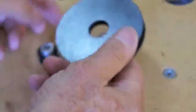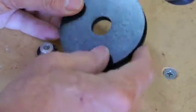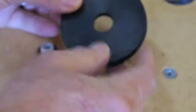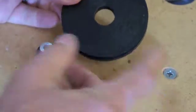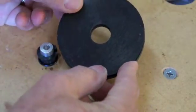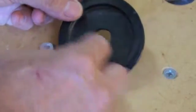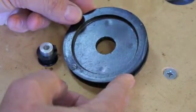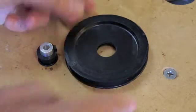And I like the plastic ones because they all come made for a 1/4 inch shaft, and so I have to turn that hole out larger. In my case, on the Jet Mini lathe, I need a 3/4 inch hole. By using the plastic pulley, I can mount this on my regular wood lathe and enlarge that hole without the need for a metal lathe. You can also get metal pulleys, but to machine that out, you're going to have to use a metal lathe. Don't try and turn the metal on a regular wood lathe.